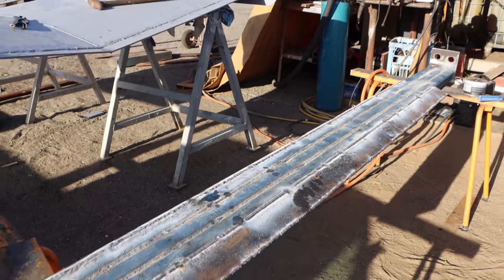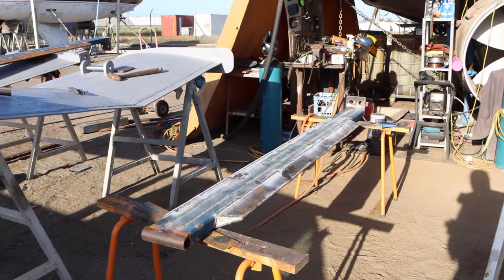We will probably fair them in, but the reason we welded that fully is Tony, the sandblaster in the yard here, he's bloody good when it comes to corrosion and figuring out what's going to last and what isn't on trawlers. He said, no matter what we do, that's going to crack apart and you're going to get water in there and then rust and you're going to have a whole bunch of dramas down the track. May not happen for 4, 5, 6 years, but either way, it will happen. He said, if you buzz a weld down there, problem's gone, don't have to think about it again.